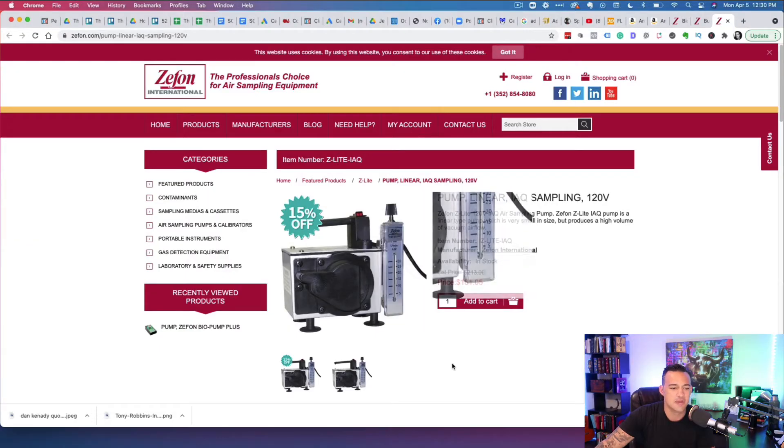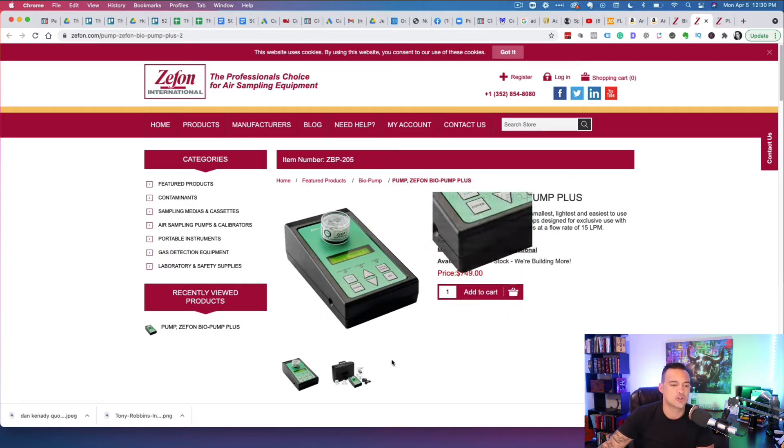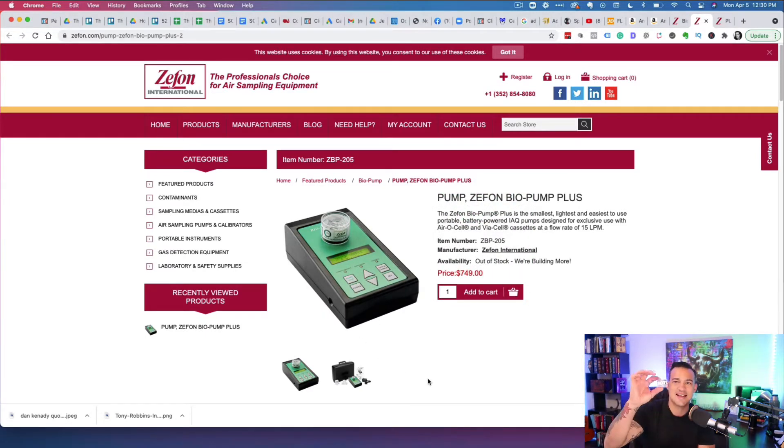It can be hooked up to an old-school pump like this, or typically you'll see something like this — some variation of a pump. As you can see on the screen, this little cassette sits right on top, and all it's really doing is sucking air from one end while the other end is open so that ambient air gets in. Depending on the cassette and how they do their testing, sometimes they'll go ahead and suck air for about 15 minutes or so. That's basically the go-to tool — the indoor air quality sampler. However, indoor air quality, especially using these cassettes, isn't an end-all be-all. This is just a snapshot in time.